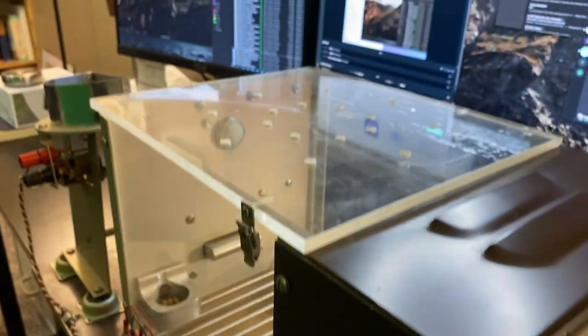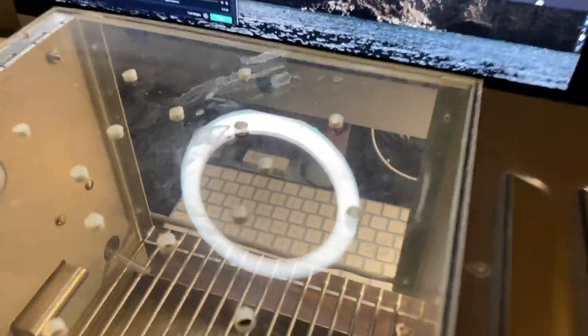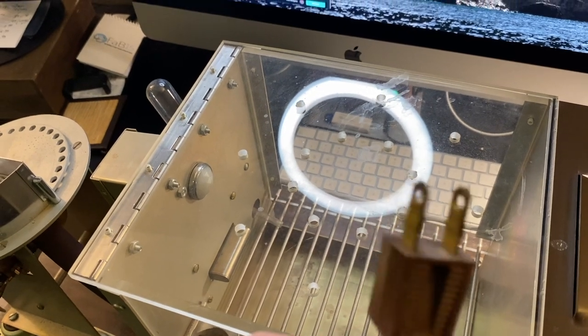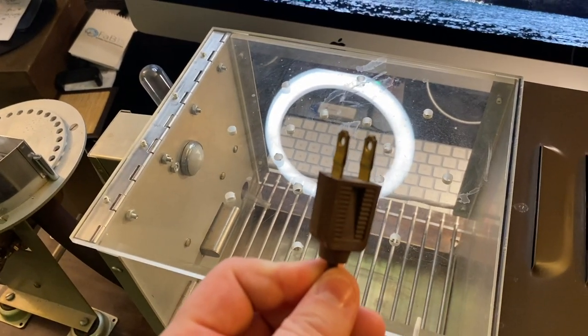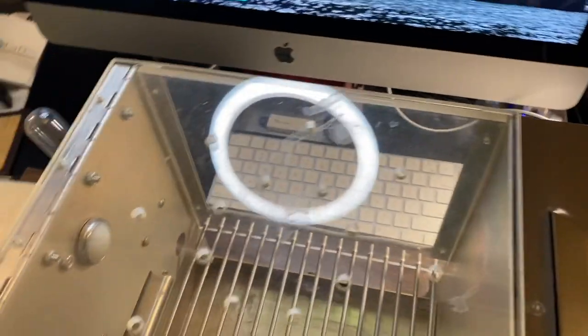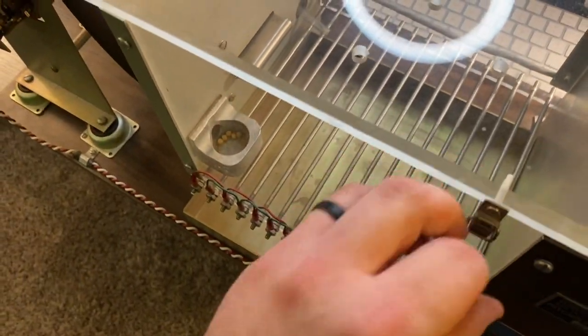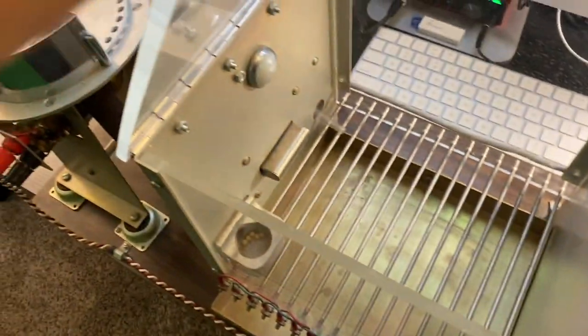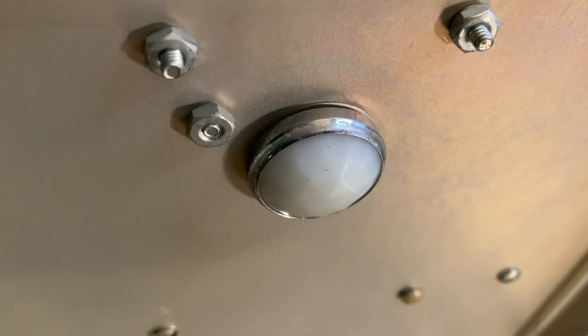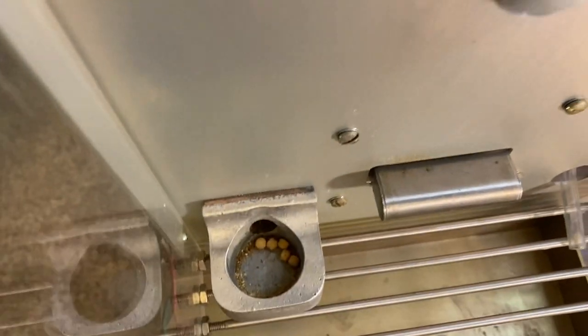You can turn it on — although it's not plugged in — so that's your 112 volts, 60 hertz, two amps. It's not a lot of power to run this thing. You don't want too much current going through here because current is the thing that actually harms the animal — and you — current is what goes through your heart and stops it. Voltage is what produces the shock.